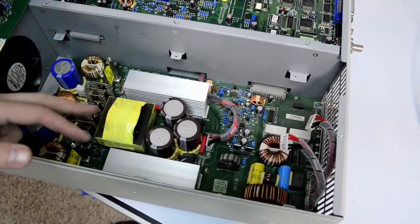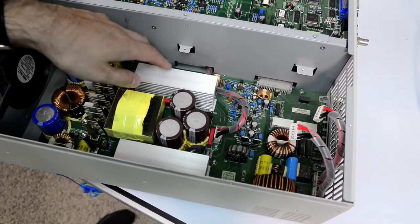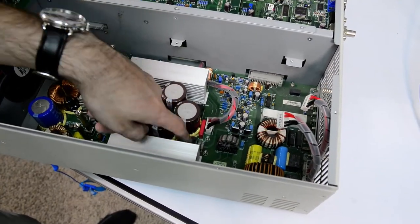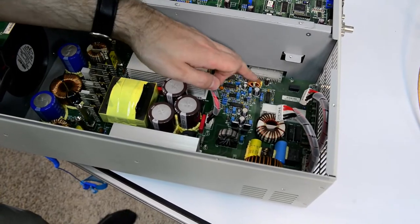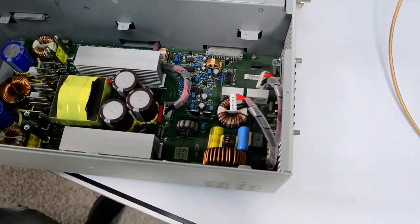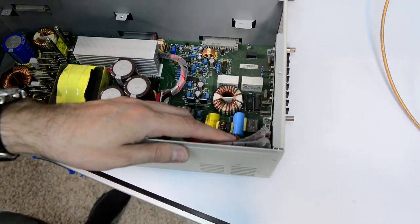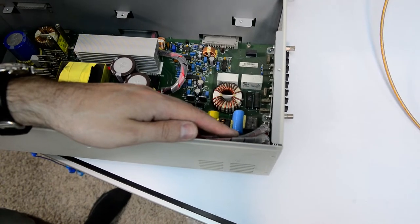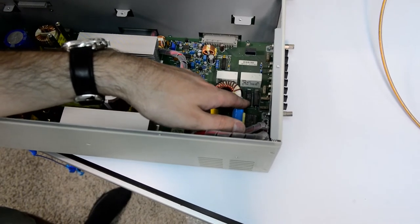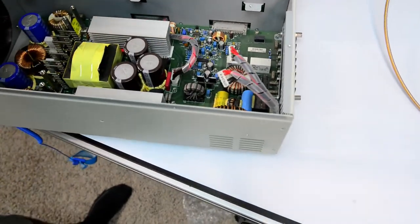Also, I think these heat sinks have two MOSFETs based on the labels on the PCB on each side. There are some current sense shunts, current transformers, some auxiliary circuitry, and a big inductor at the output, and these are all the output terminal blocks. There are some film caps, 3.3 nanofarad, and these two are shunts used for measuring output current. These are Dale LVR5, and let me check what's the value for the shunt.